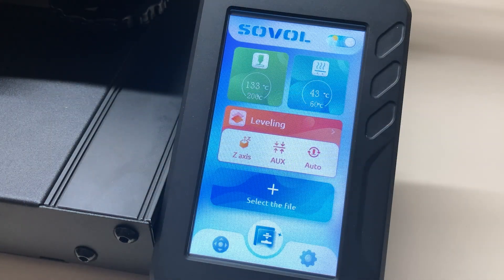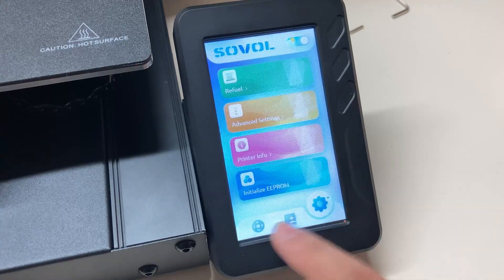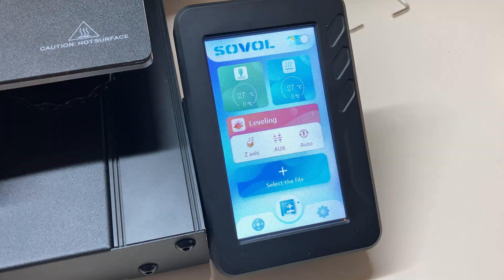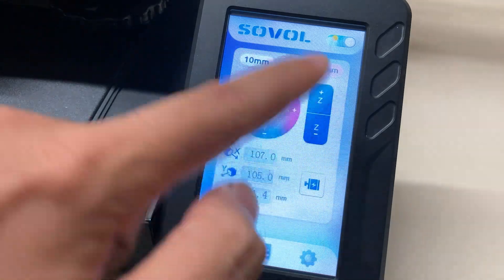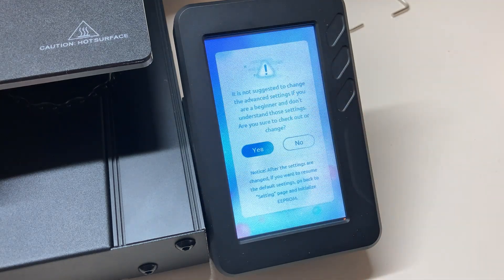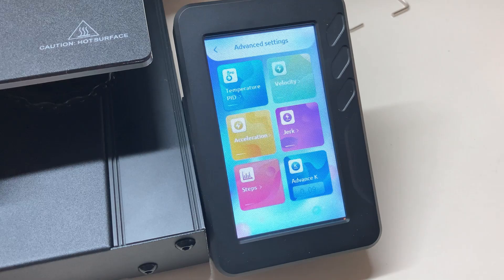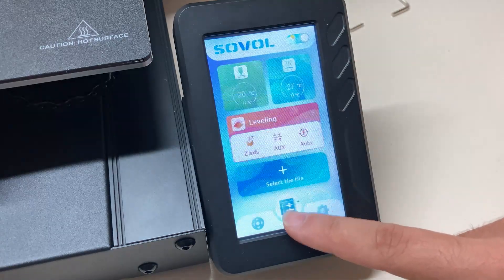While printing, let's look at the screen interface. The interface is really unusual and the touch response is nice — detects in one go. It's very colorful, and in the top right there's a night mode, which I've never seen on any printer before. There are basically three sections: settings like motion and positions; options for heating, leveling, and printing; and an advanced settings section with things like filament change or motor step and speed changes — usually you'd need a computer for that. Best of all, the printer comes stocked with features like linear advance and PID tuning, which most printers don't have accessible in the interface.